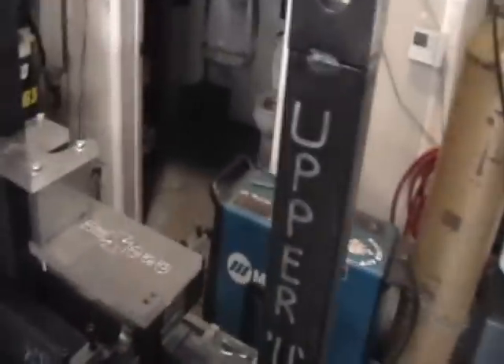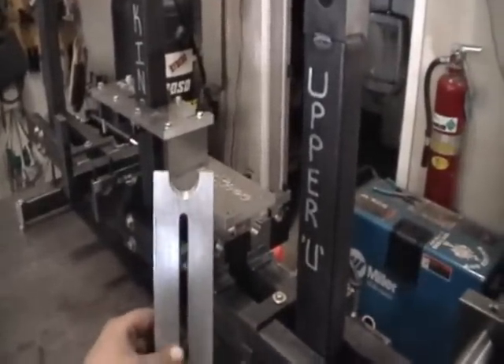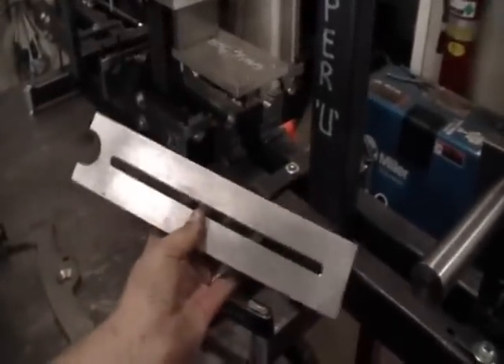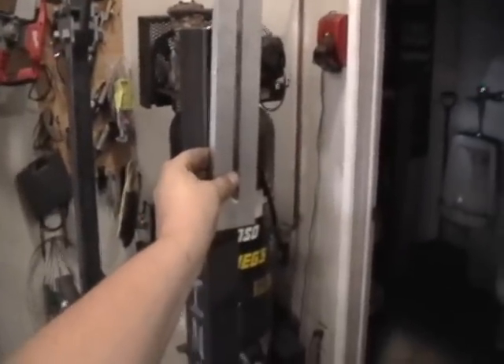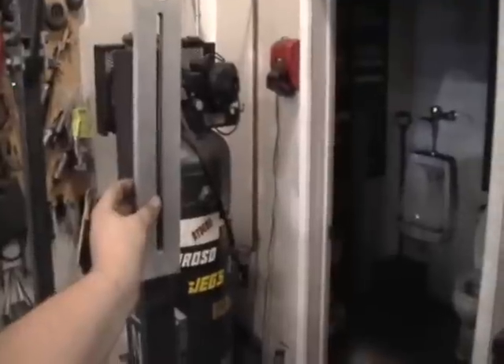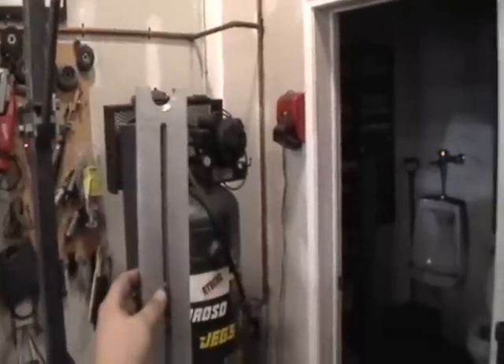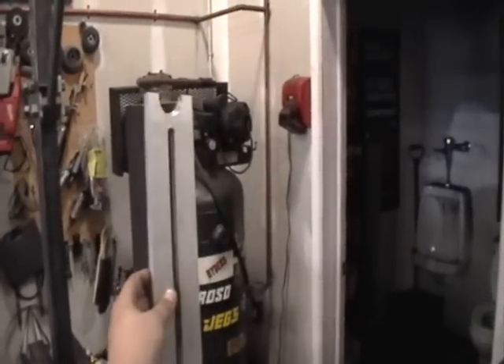Another part that I made is a little aluminum piece with a notch in the top that would match inch-and-a-quarter tubing, which is what we normally use when building a frame. We're going to attach this to the back side of the king post with a couple of bolts, and that will allow you to move it up and down and clamp it wherever it needs to go. That way you can locate both the height and the side-to-side squareness of your backbone tube.